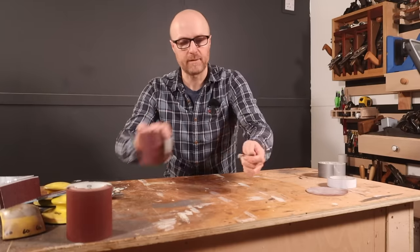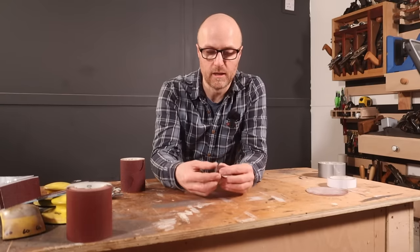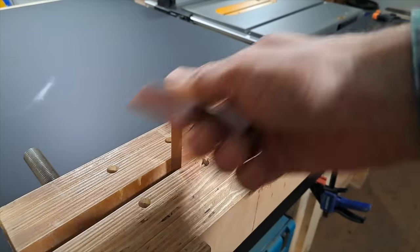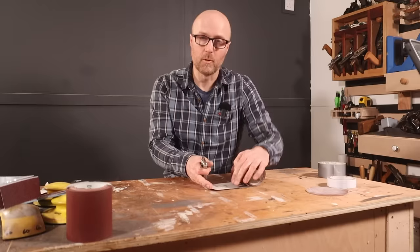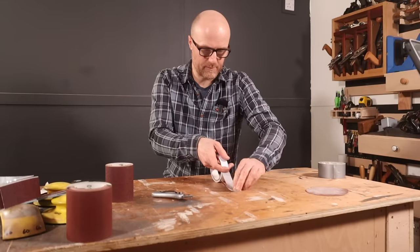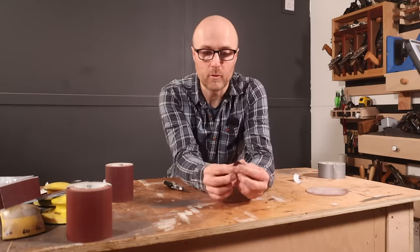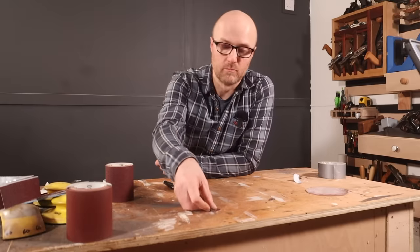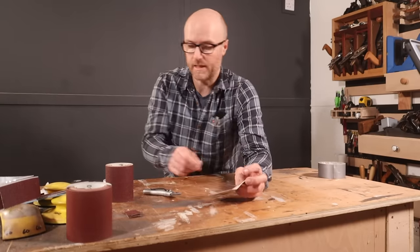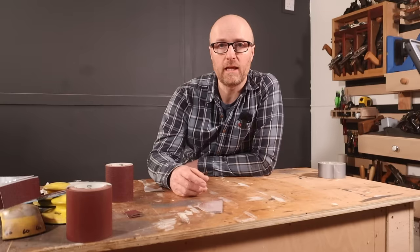If you're used to just tearing off a little bit of sandpaper to get into a gap and rub something down, you must know already that this is a really difficult way of holding the sandpaper. I bet what you then try to do is fold it over so you've got grit on both sides, but also one fold of grit on grit so that when you're rubbing it doesn't unravel and fall apart and you lose grip — and that's okay. But what I'd suggest is: cut a piece off, get yourself a couple of pieces of double-sided tape, fold it over on itself so it's nice and flat, then try that. You get grip all around and it isn't unrolling on you when you move it, and you get to use more of the sandpaper — every little inch of it. The same goes for discs — they slip against each other; a small piece of double-sided tape will not come off on the fluff easily.